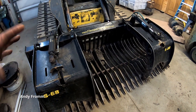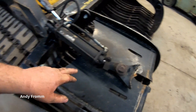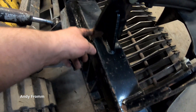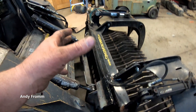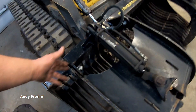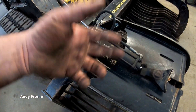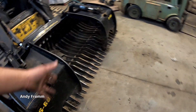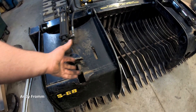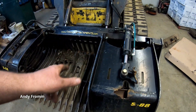It's the operator's fault. But I've put this thing through quite a bit of stress, and besides these tearing off, bending the cylinder, and these pivots wearing out, I did have some cracking back here so that could be reinforced a little bit. I'm not going to fix this the right way right now — I'm just going to patch it, let it get a little bit worse. I just want it to be usable, so let's pull this stuff back into submission and weld it back up, maybe throw a little bit of bracing on this area so I can use it again.